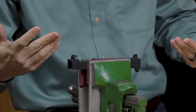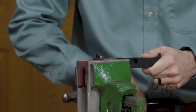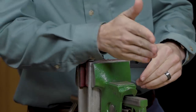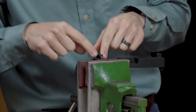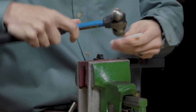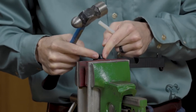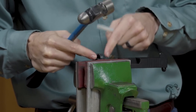This is how punches get broken a lot too, trying to drive that sight out. Now, if you take this same sight and position it in the center of the vise — right in the center of your jaws here — that sight or the workpiece you're hitting is going to be able to absorb the most energy. So you're not going to work as hard moving that sight. Give it a few taps like this and you'll notice that it's a lot more solid and you're going to have to exert a lot less energy to move this sight.